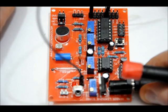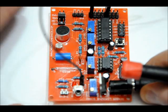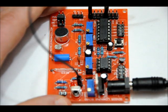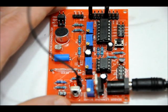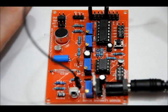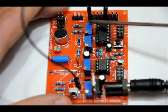If I cover up the LDR quickly and hold my hand there, you see it light up but then it goes out again — that's because it's reacting to that single change in light. The other circuit we'll go through in the next video will have an on/off effect, so if you cover it or break the laser beam the LED will stay on or off and reverse when you remove your hand. But right now, a quick change in light over the LDR lights up the LED — that's exactly what we want.